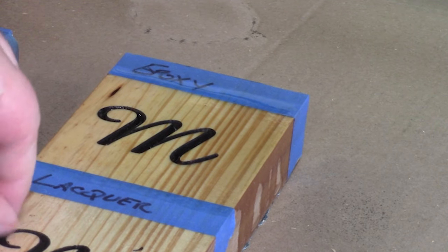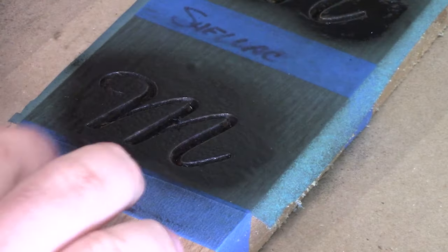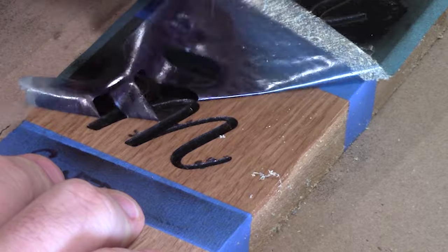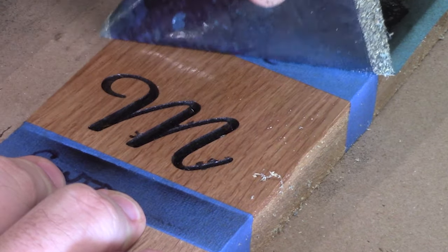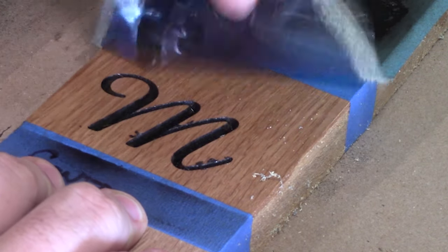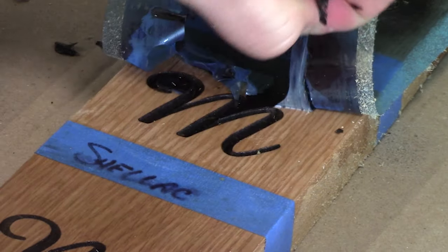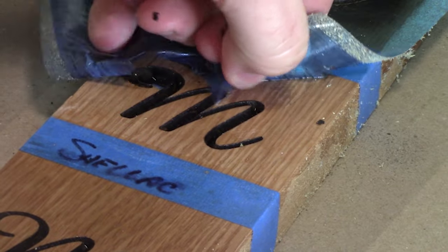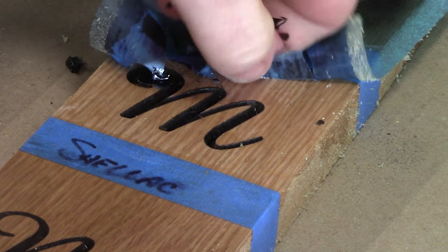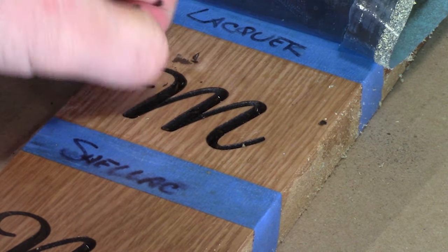You do see a little bit of grittiness in there because I didn't sand it down to a fine finish, but that wasn't the point of this exercise. Now let's move to the white oak — with the shellac, there's a little bit of bleed, not much, and hopefully that's on top of the shellac so I can sand it off. Next, we'll move to the lacquer, and the lacquer gave us a really good finish. You can actually see at the top of the M that a little bit of flakiness flaked onto the wood, so I'll have to address that.